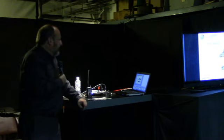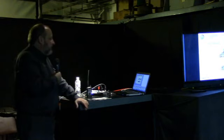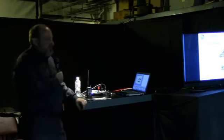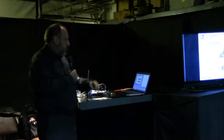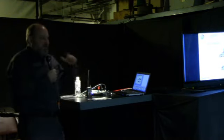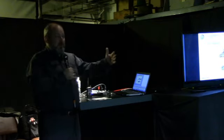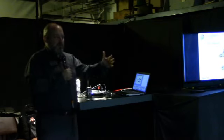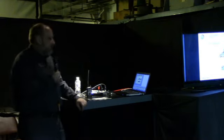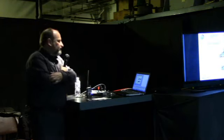I see. So here's the basic layout. On the 2 meter band, there's the DV mode, the digital voice mode available, and there's radios available for that. 70 centimeters is, again, the DV mode only, so that's the voice and the low speed data. On 23 centimeters, on 1.2 gigs, you can have the DV mode and the DD mode, because there's enough bandwidth up there. This channel is like 130 kilohertz wide to get this 128 kbaud data. So it requires a lot more spectrum, and worldwide, that's only available at 1.2 gigs.